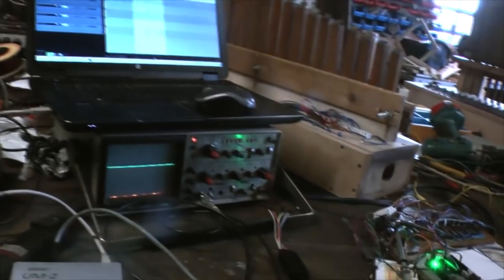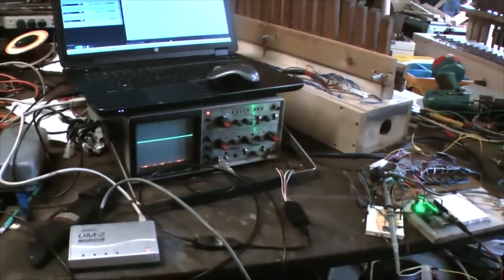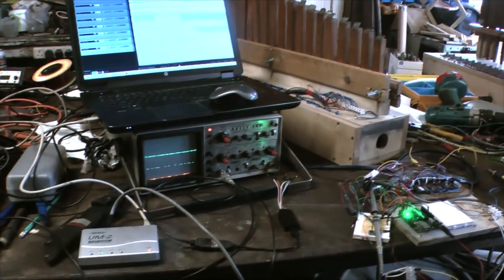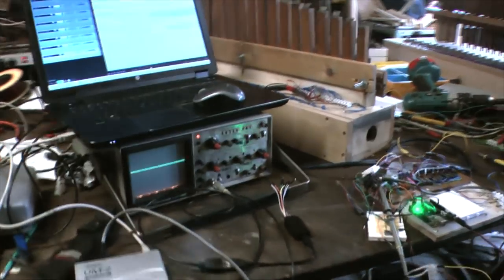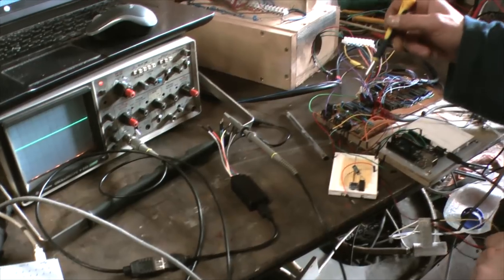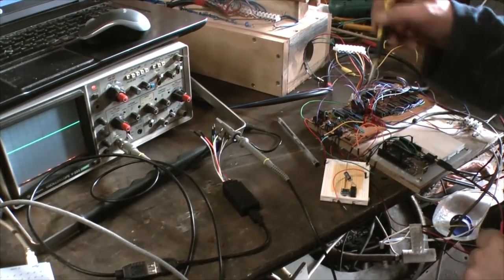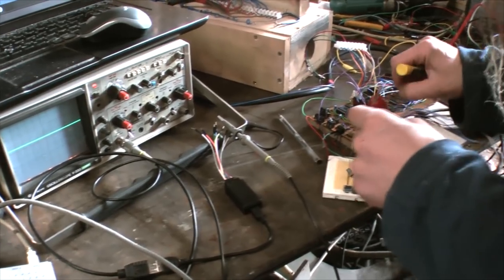Should be seeing regular MIDI data coming out of that, but we're not. That's the MIDI data, or we're seeing bits of it, but it's not really corresponding to all the notes that are coming out. Why is that then? Just start from scratch, from the MIDI input out to the Arduino connection, and we should be able to find if there's a wire off somewhere.